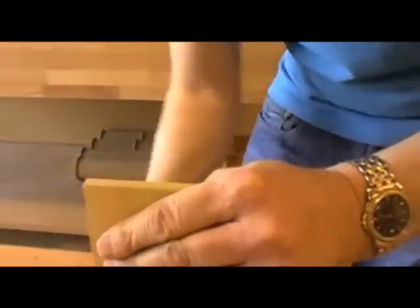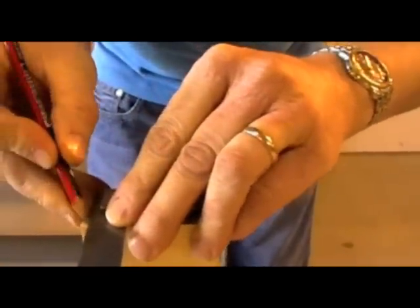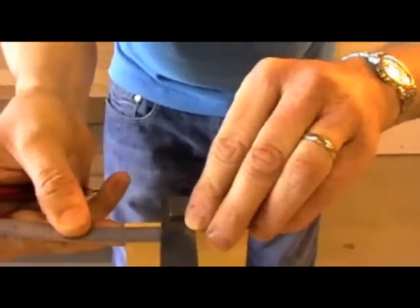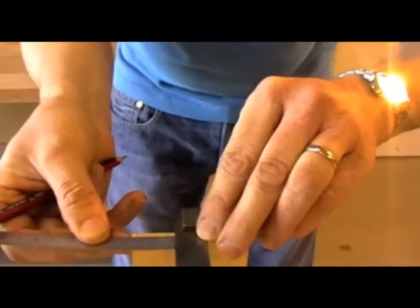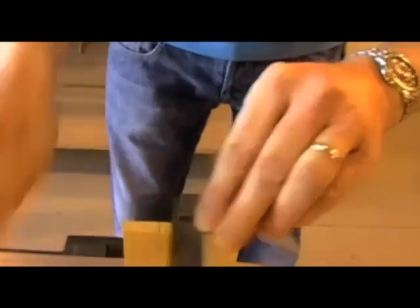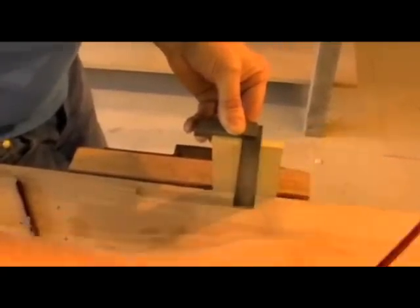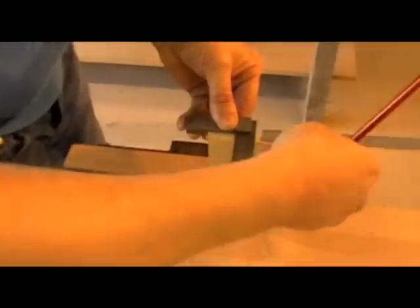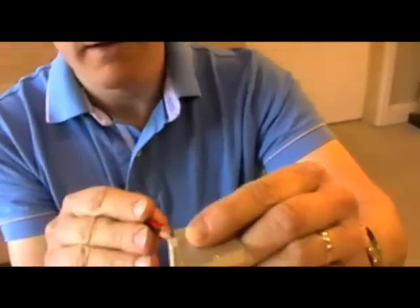The end of this one — four millimeters — that's the end of my half pin. I'm going to come in to 22 and then 26. Same from the other edge. Dovetail template — transfer those down the face of my timber.